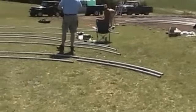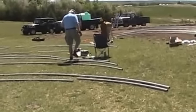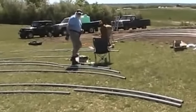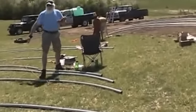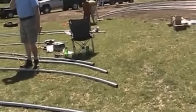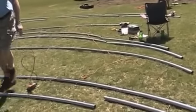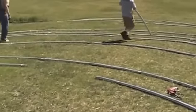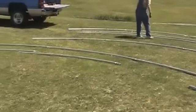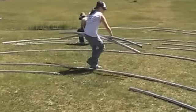What we are doing now is assembling more of these rafters. John Tesno is using a high-speed drill to drill through this galvanized steel, and we are assembling them. They are in five parts, and each part has to go in appropriately. You put them together with the bolts and make the hoop, and this happens to be about 30 feet wide and will be almost 15 feet high.